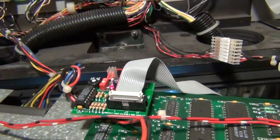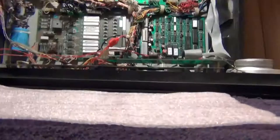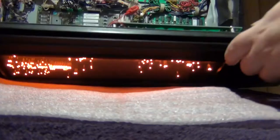I had limited instructions when I first did this and did not know the correct way to orient the DMD saver when plugging it back in. I'm going to show you what happens when you accidentally make your DMD saver flush with the pin one side of the board — as you can see, the display is completely gibberish.